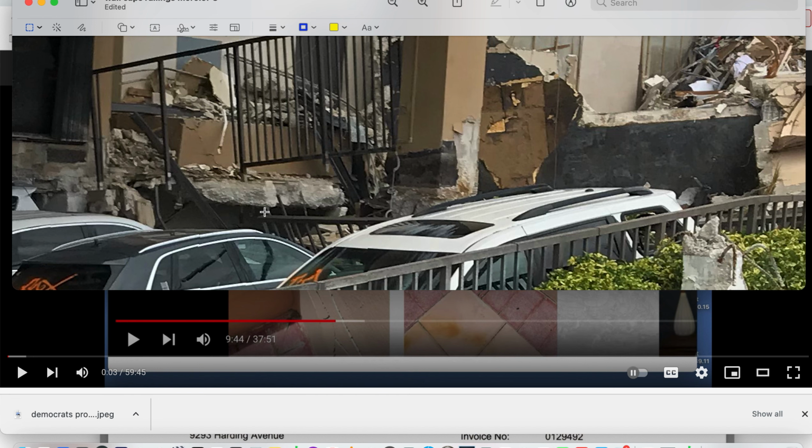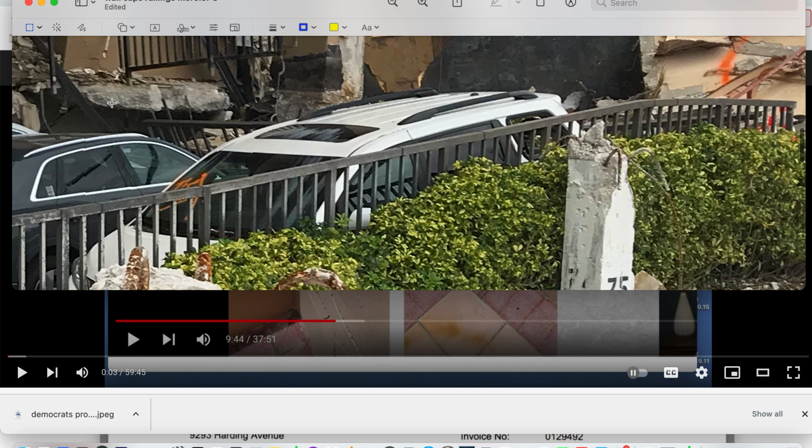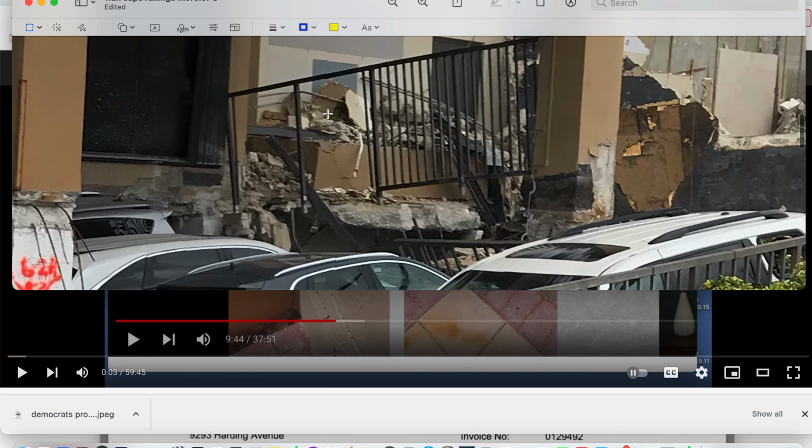So the stages are such that I would argue that it's some, if we have more imagery here, see this fracture here? Remember I showed a video with the fracture at the top of the deck. I hope to link it below or you guys can request it. That fracture there aligns roughly with the fracture here. And this would give us our plane or deflection.